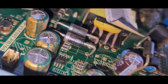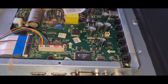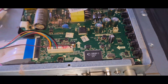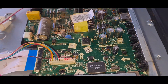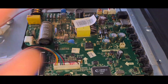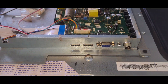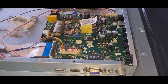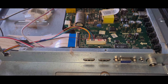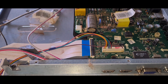So these are 330 35V capacitors. The problem you saw on this TV will be fixed when we change all three capacitors. I'll check for any shorts on the board - there are none - so I'll take out this board to my bench and change the capacitors. Stay tuned, and if you haven't subscribed to our channel, do well to subscribe. There are more informative videos coming, and you can click the link below to join the channel.